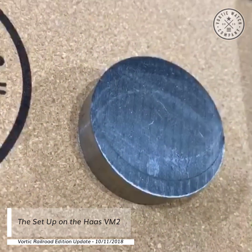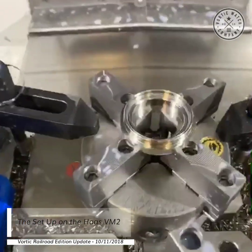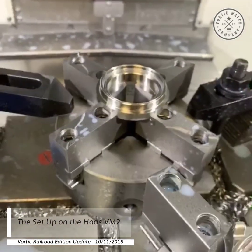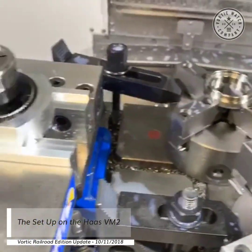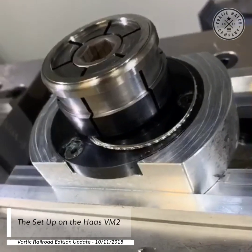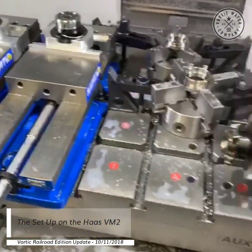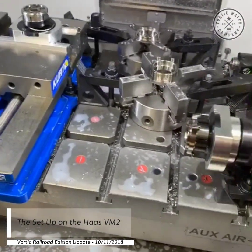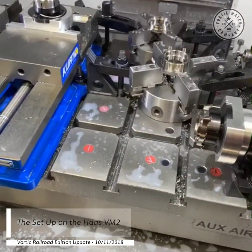Next we have that smaller piece of titanium — that's what the bezel is made from. First stop is the inside of the bezel, the part that gets threaded to meet the case. That operation takes a very long time because there's a dovetail cut inside and we have some embedded O-rings in there. Then finally we have the second operation on the bezel, before we put the slots or flutes in. All five of these steps take about four hours of machine time, getting us everything except for the flutes.